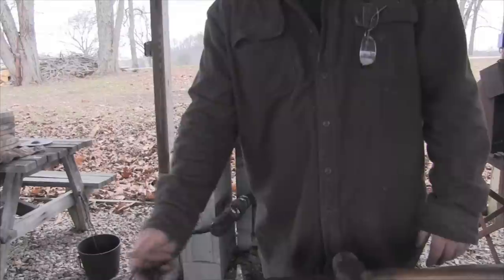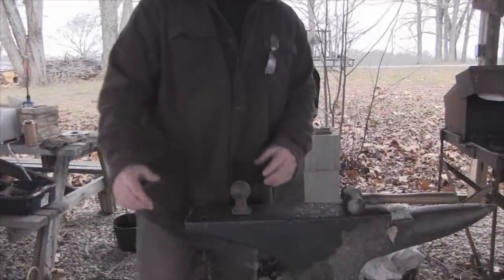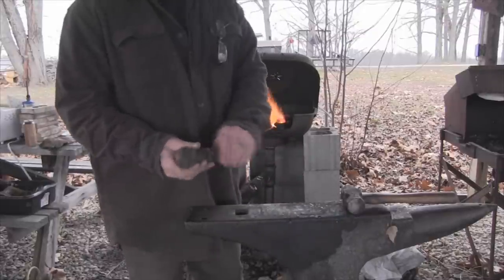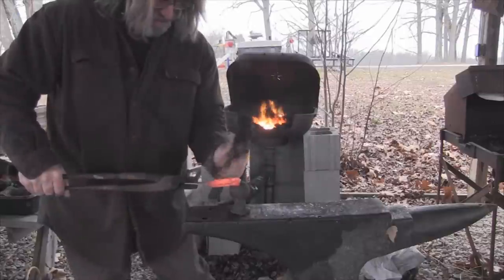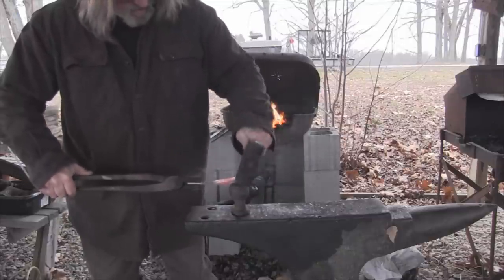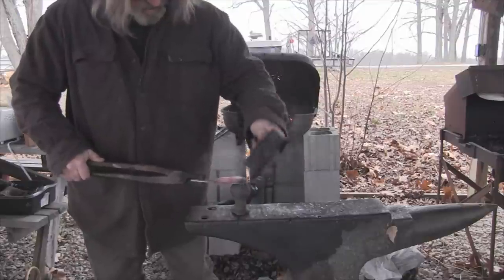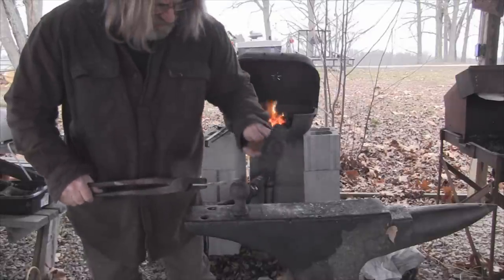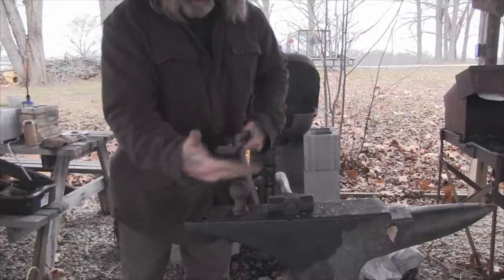We have to go ahead and make our bend before we do all this. To make a bowl adze, we're going to have to bend one blade over. I'm going to use this little trailer hitch that I've beat down into a hardy tool to roll that edge over on top of it. Can't put too much of a beating on this because we don't want to bevel the edge, but we do want it curved.